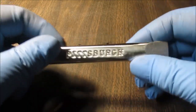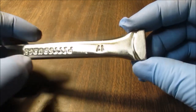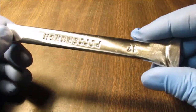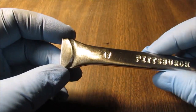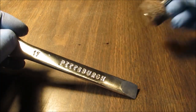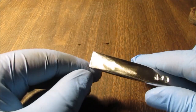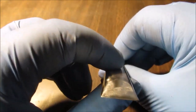We're done making a tool out of a cheap wrench. I would rather use an old made-in-the-USA hard steel wrench because this metal was not easy to work with — it's just not the same type of steel. I took my red abrasive wheel, it's almost gone, because I don't want it real shiny so I knocked it down a little bit. I took a lot off to make this flat because these wrenches have a curve to them.